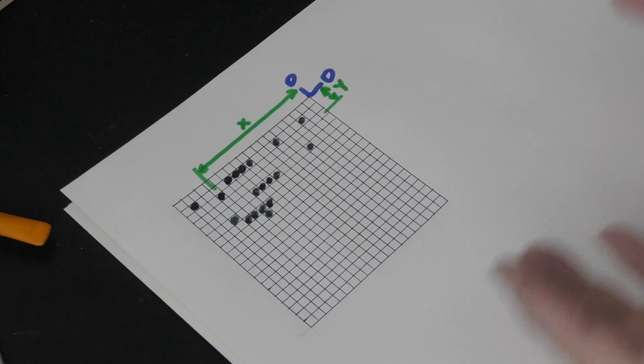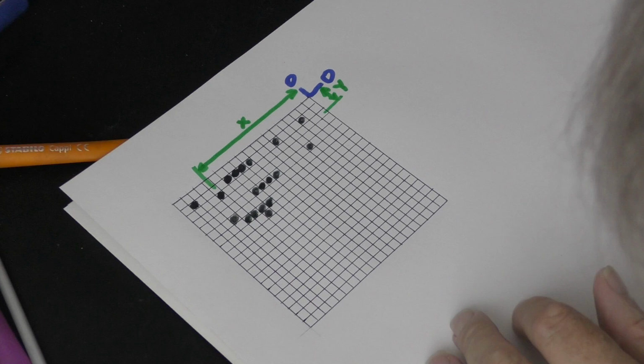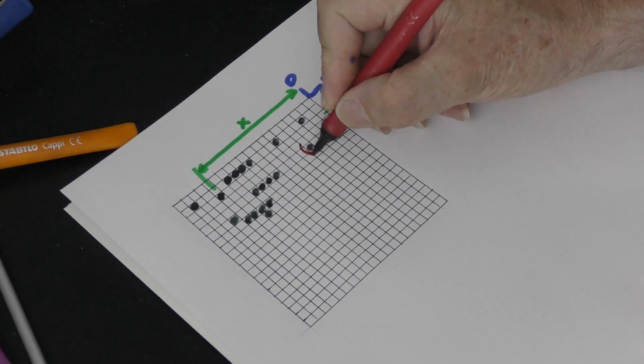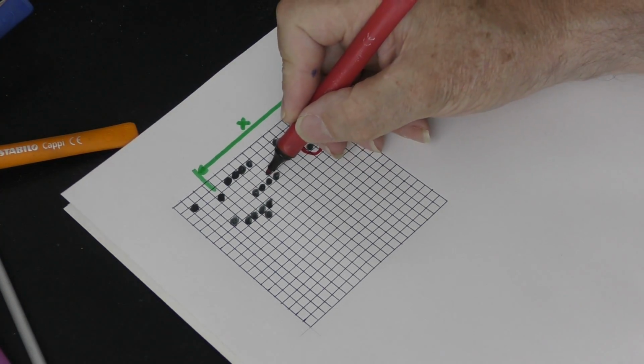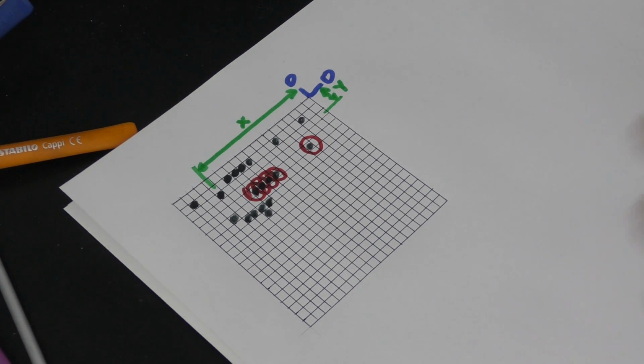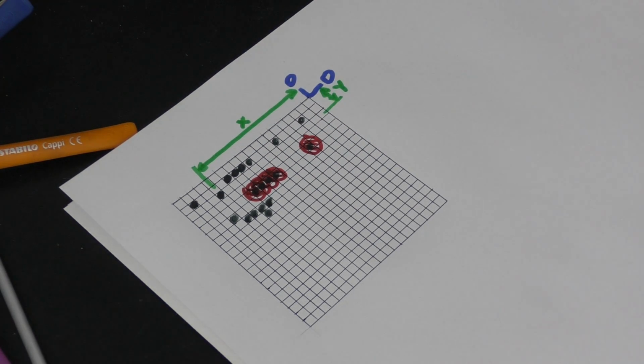You can produce wonderful pictures on the screen, but if your picture on the screen is like that, but the dots that you're able to produce are that size, then look what's going to happen. Basically, what you're going to do is change the ratio of black to white in your image. You're putting great big black dots down instead of small black dots. So you're masking some of the white, and your picture will look, as I said, like my early pictures, barbecued wood.